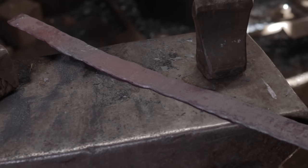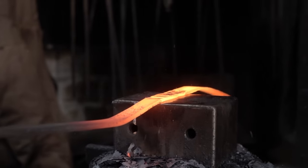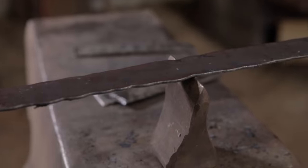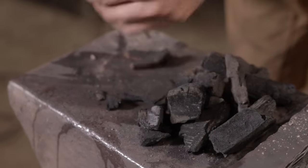The idea behind this experiment came from attending a presentation by Rick Furr. In his presentation, he describes the possible way carbon was introduced into Scandinavian blades by merely forging them in charcoal. That is, he talks about how the blades were most likely, or at least most of them, made of iron, but the presence of carbon under high temperatures introduces some modicum of steely bloom into what starts out as iron bloom. And that is not surprising, because if you think of an iron bar as a dry sponge, as soon as you place it next to a source of moisture, the sponge will absorb it.